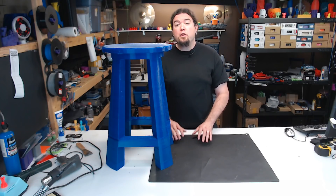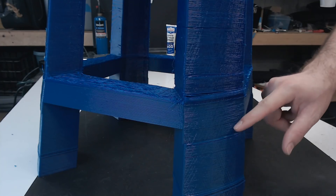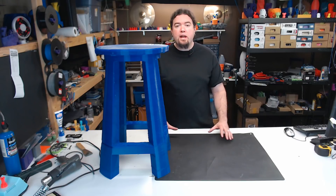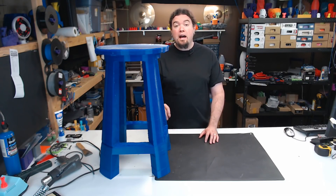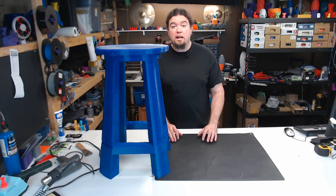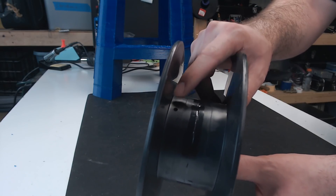I also had quite a few layer shifts during the print. The layer shifts were pretty significant when it started the foot rungs, and also at the spots where I changed the filament out. When printing with a hang printer, you end up with a vase-shaped build area — you can print larger at the bottom, but it gets smaller as it goes up. This model was actually just a little bit too big for my build area, and the line did get hooked on the legs of the stool, which contributed to a lot of the layer shifting. I also noticed shifting when the filament needed to be changed, because the last bit of filament would be hooked on the spool and tug on the lines.